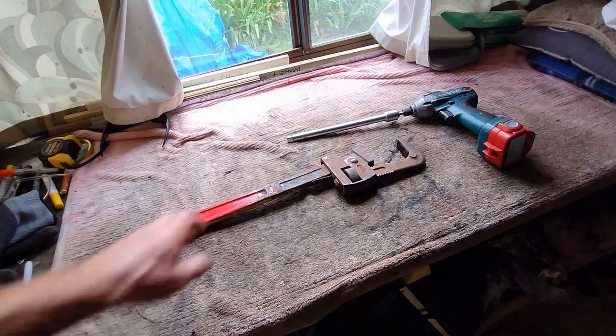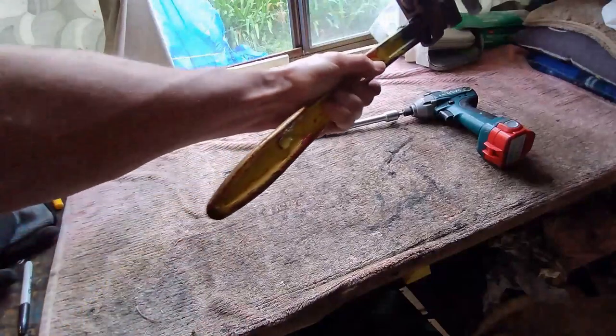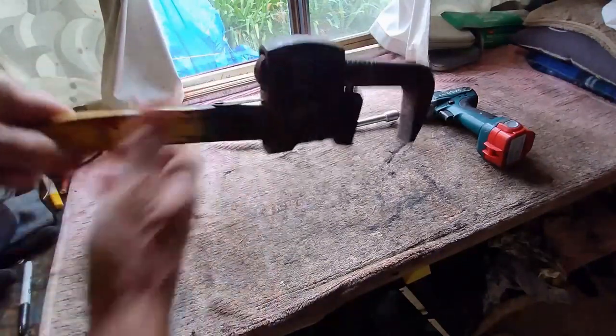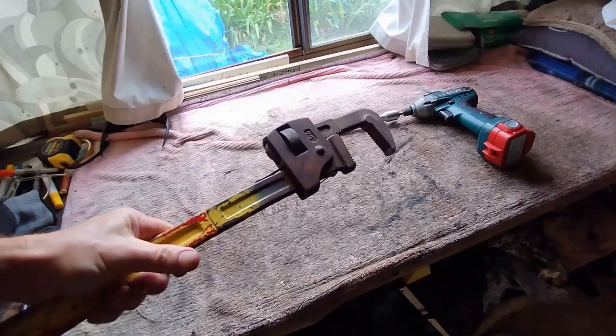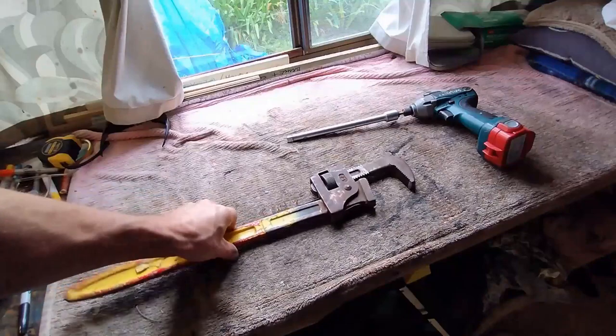Here are the tools I use. That's a plumber's wrench. It's a fairly big one. You adjust it like that, and you can turn the rod inside the metal drum on the roller door to increase or decrease spring tension.